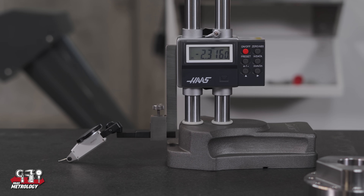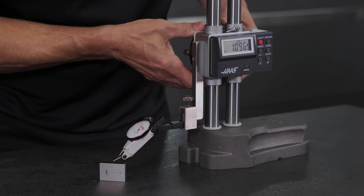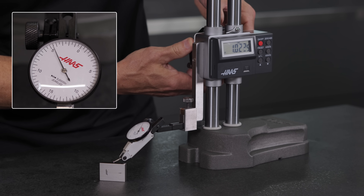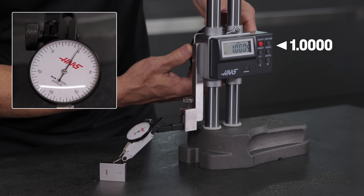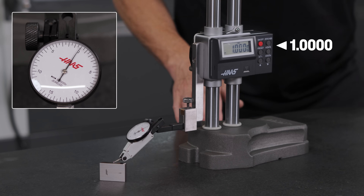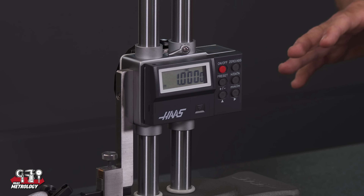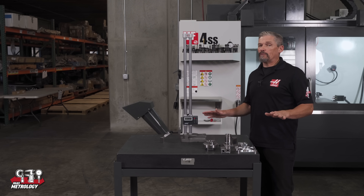I'll press the zero button to set my zero on the digital readout. Now let's come up and see what we get on the gauge block. It's reading 1.0000. But remember, if you need accuracy better than the one to two thou range you need to use a different method or tool. Just because the readout says 1.0000 inches out to four digits, the resolution is only to five tenths, and the actual accuracy is plus or minus one and a half to two thou. That's what height gauges in this class will get you, from any reputable manufacturer.